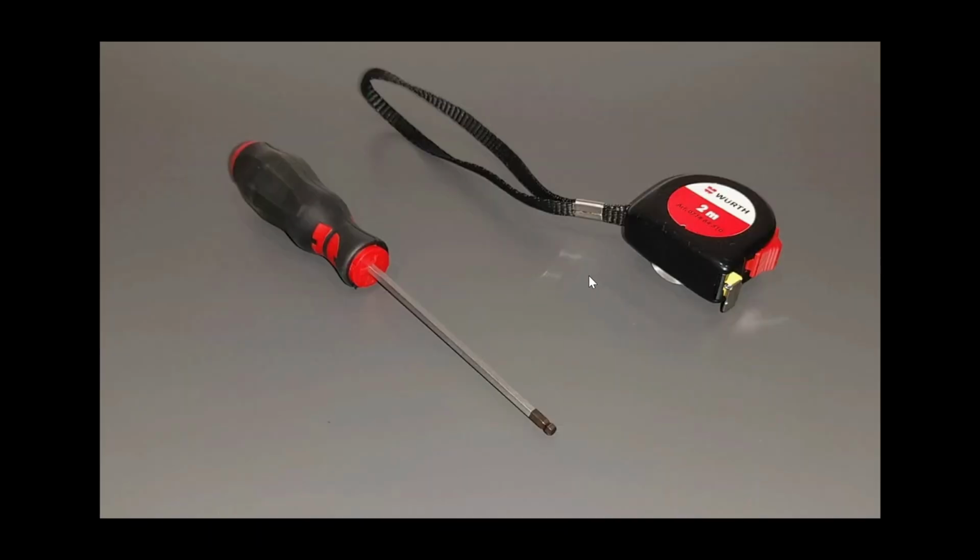So it is very important to collect the cables and fix them to the tripod to avoid any kind of movement during the scanning sessions. Also, this scanner has the possibility to change the field of view, so we provide the tools for changing the field of view. The screwdriver on the left is used for moving the cameras and fixing them every time we want to change the field of view. We also provide a tool for measuring the distance between the cameras and the calibration plate, what we call the working distance. It is always to be used when we set up a new field of view.